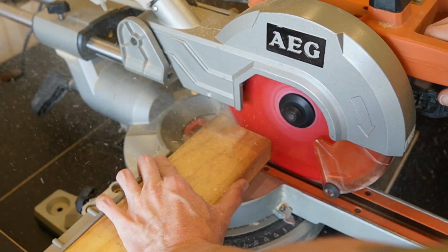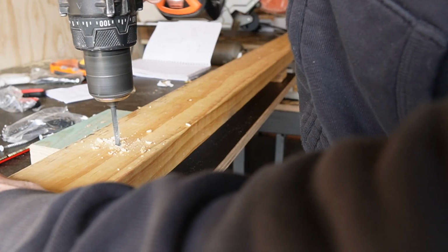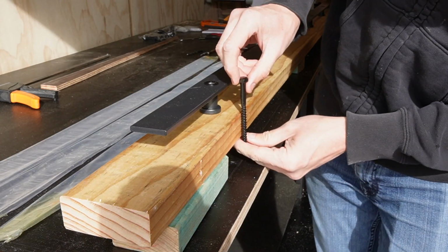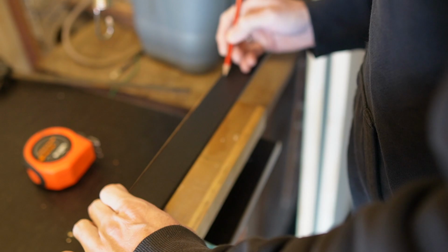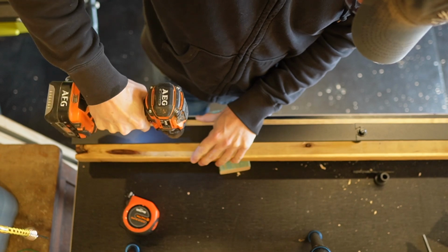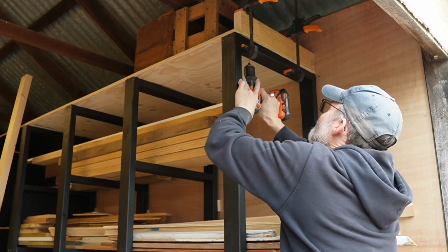Cutting the board down to size, then mapping out where the hardware would be mounted, and then mounting it. Trimming off the end piece, attaching that. Then attaching additional pieces of timber on the sides and the middle of the top of the cabinet on which the hardware stud could be secured to, in addition to getting some screws from below.